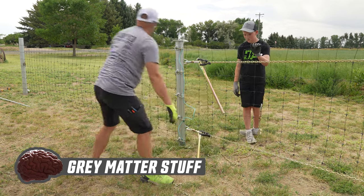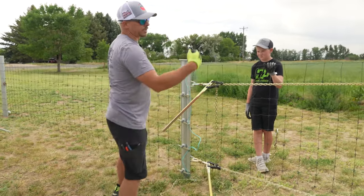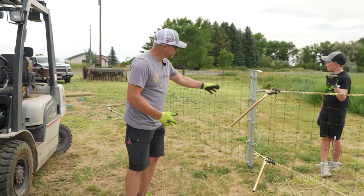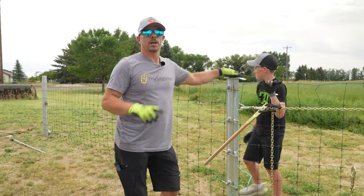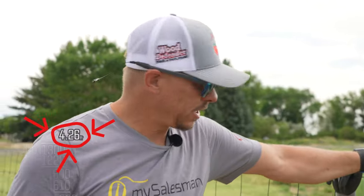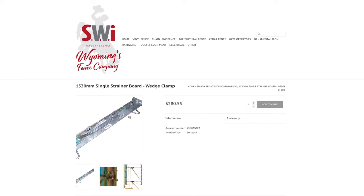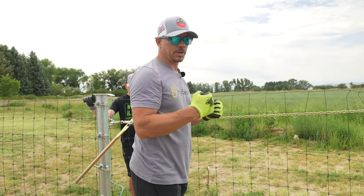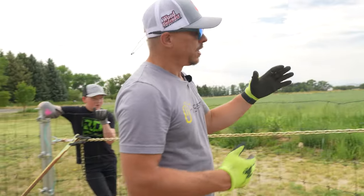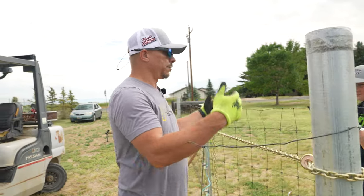We're pulling these posts over — the whole point of this video was to show you how to stretch using the wedge board strainer. The 1300 millimeter — do some math on screen and show them how much that is. We have three different lengths of these, and there will be a link down below if you're really interested. This is by far the best net wire stretcher out there, along with these two boundary strainers. This board plus two boundary strainers — we could hook another one so if we wanted to do a gut stretch, which means we pull in the middle of a run of fence and pull them together. I recommend having two wedge boards and two strainers so you can do gut strains if you need to, bringing them together in the middle and crimping them with both ends tied off — that works really well on long runs.